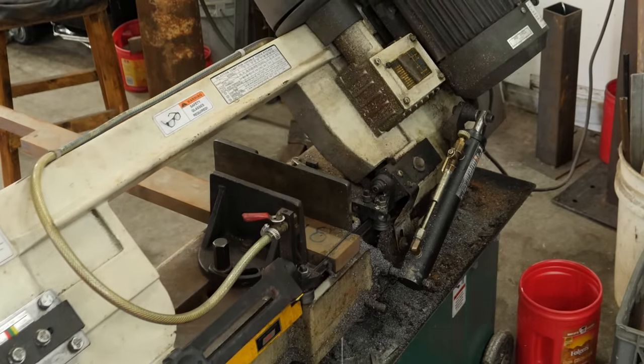I drive the guard on, then remove some material with a file and keep driving it on over and over again until the ricasso leaves a mark on the guard. I call this rotary tool the high-speed dental burr, and I'm using the tiniest of carbide burrs to remove a small amount of material to make the guard fit perfectly. To do this work with the dental burr, I'm looking through my engraving microscope so I can see exactly what I'm doing more clearly.